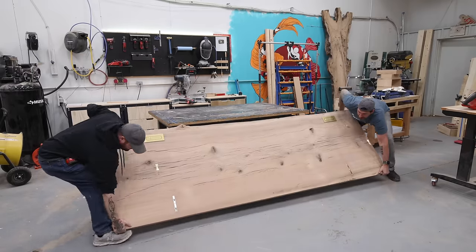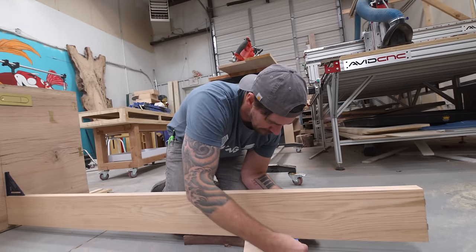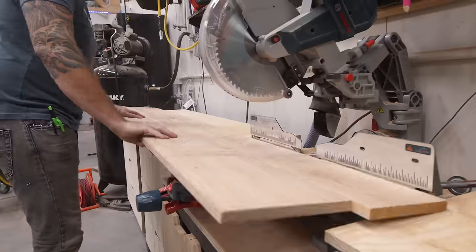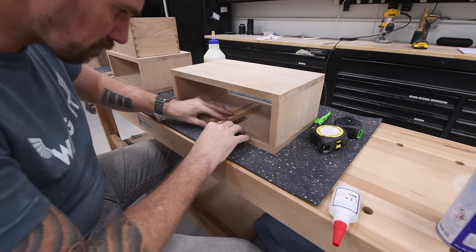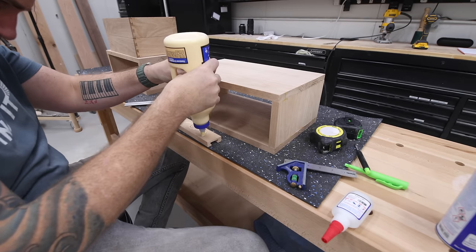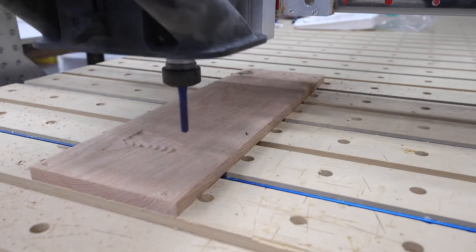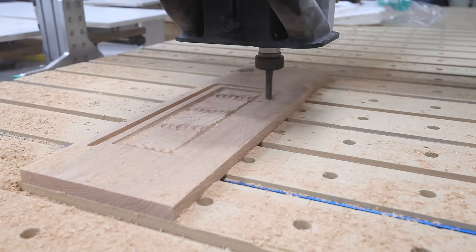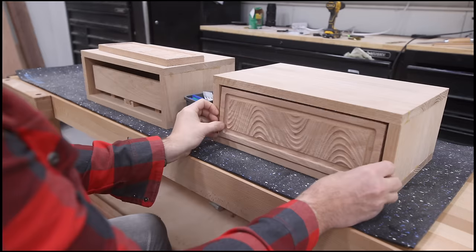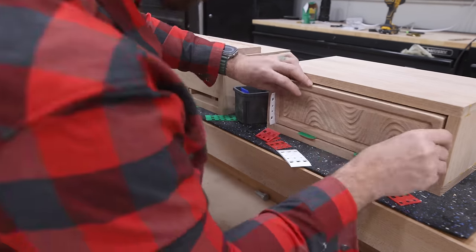Right here is that exciting time in the build where you can really start to see it all come together, but you also realize there are like a thousand more tiny steps to complete before it's actually done. Here we're fitting the rails and getting those levels so we can cut the footboard to its final width. My miter saw is just a little bit too small to cut all the way through, so I'm squaring off the end with my track saw. Getting back to those nightstands, I'm using wooden dovetail slides to install the drawers — pretty easy to install with glue and CA glue to hold slides in place while the wood glue dries. On the drawer face, I'm going to carry over that vector wave pattern from the footboard. I'm really into that vector texture technique — it's something I just learned, and I have a feeling it's going to pop up in a lot more of my projects coming up.